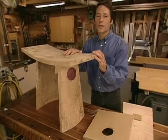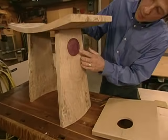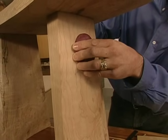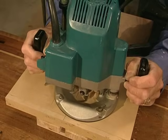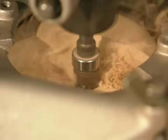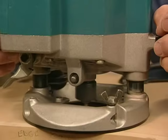On this example of our Japanese style sitting bench, you can see that one of the key design elements is the sculpted purple heart disc — a really nice design element. We don't want to just glue this onto the side, so we've actually cut away some wood for the disc to fit into. We use another template with our flush bearing bit, this time set at 3/16 of an inch, to make the recess. With an accurate cut, the purple heart will hold firmly into our legs.